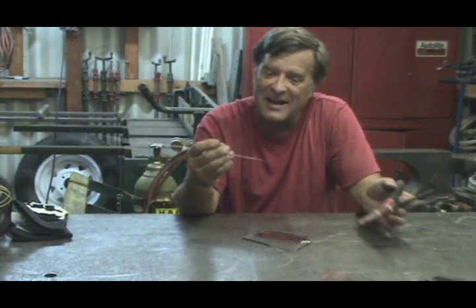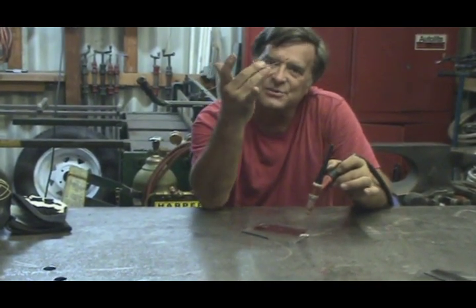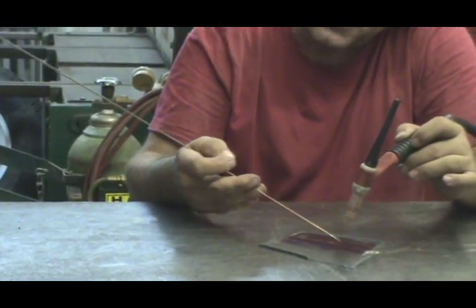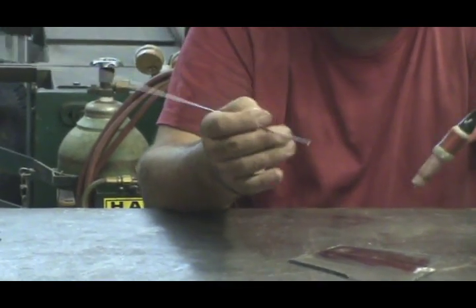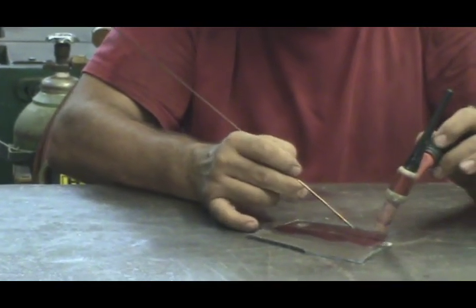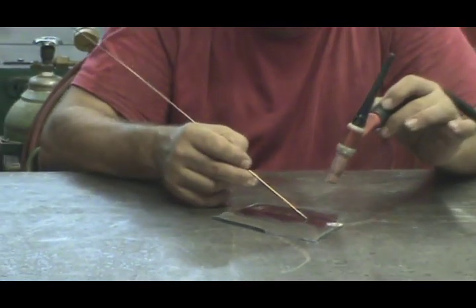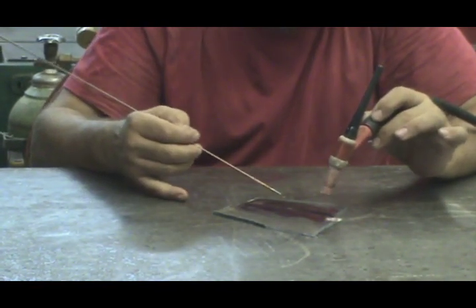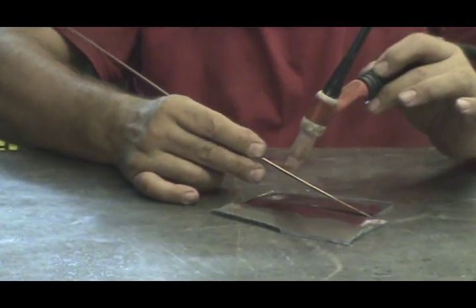There are a couple of different ways I like to feed the wire when I'm working. I hold it in those two fingers and against my thumb, and I can just feed it right in as I'm going along, keeping a smooth feed going. Another way I find myself doing it is: as I've got my puddle going, I'll weld my rod right to my work, back away with my torch just a little bit, slide my hand up on my rod, then come back and cut my rod loose and just keep feeding it in.